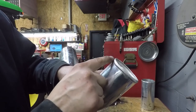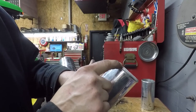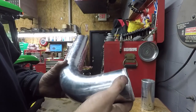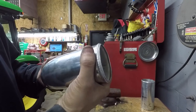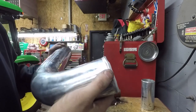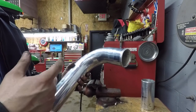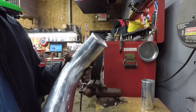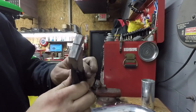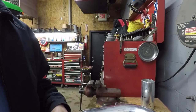You can see the bead follows the cut, which is pretty handy — if the bead went perfectly straight you'd get a malformed bead in one spot and that would allow the silicone to maybe come off right there. This way you get a nice bead all the way around, and there is no way that's coming off when it's clamped properly. It took me about three minutes to do this one — my truck needed six pipes total, so you can do it in under 20 minutes with this four-dollar tool. There you go: your $3.99 Harbor Freight bead tool.